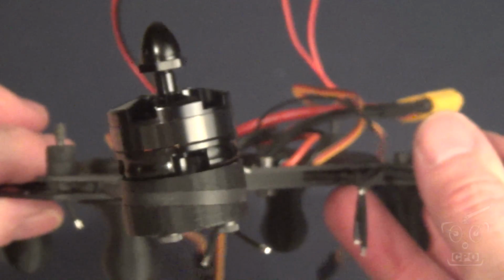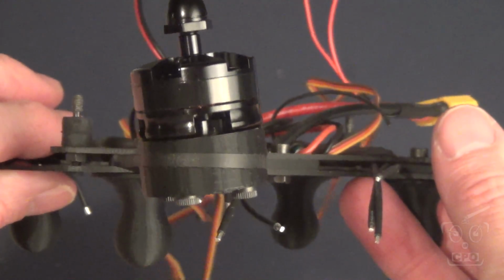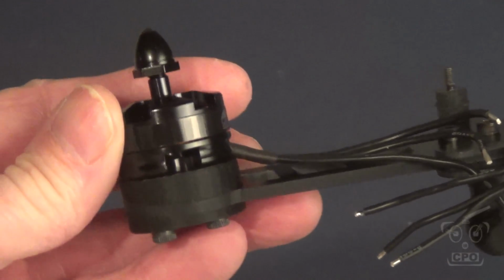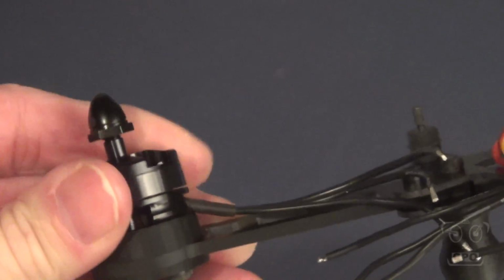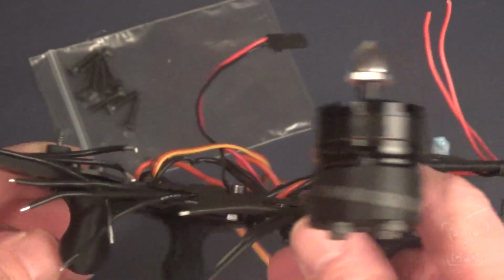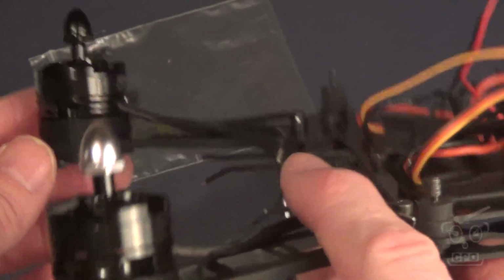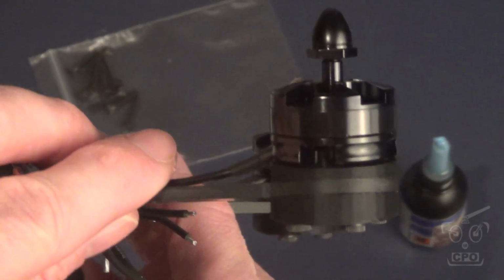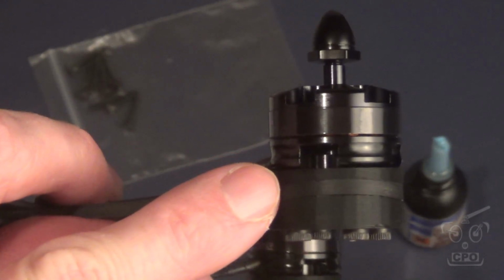threads on the motor will hold them in place. But you can see there I've got a 10-degree tilt forward now. Make sure it's tilting in the right direction. The skinny part of the wedge goes forward on the top, and the fat part goes forward on the bottom of that mount. It makes more sense once you take a look at it.